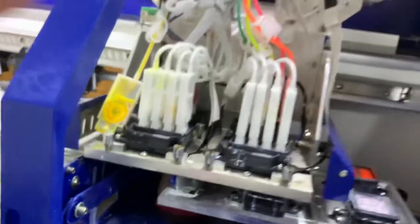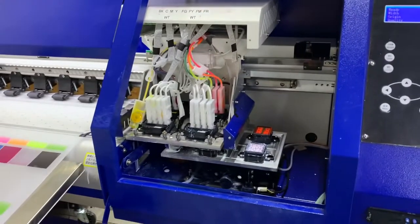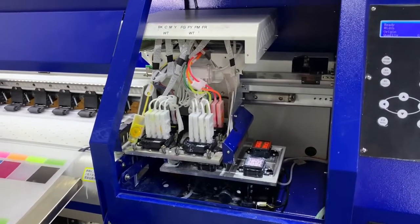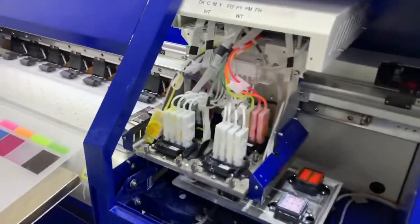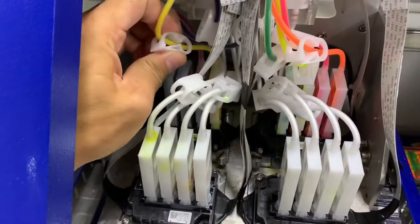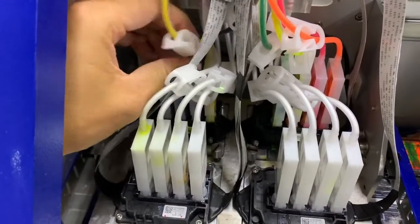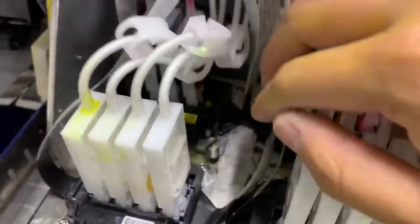Make sure you turn off the printer. You don't want to do this cleaning with the printer on, and you also don't want to get any ink or water anywhere, so be careful. Next thing you want to do is close off any of the ink circulation — I'll cap off yellow since that's the channel I'll be working on. I'll move the damper aside; that's the channel I'm going to be flushing.